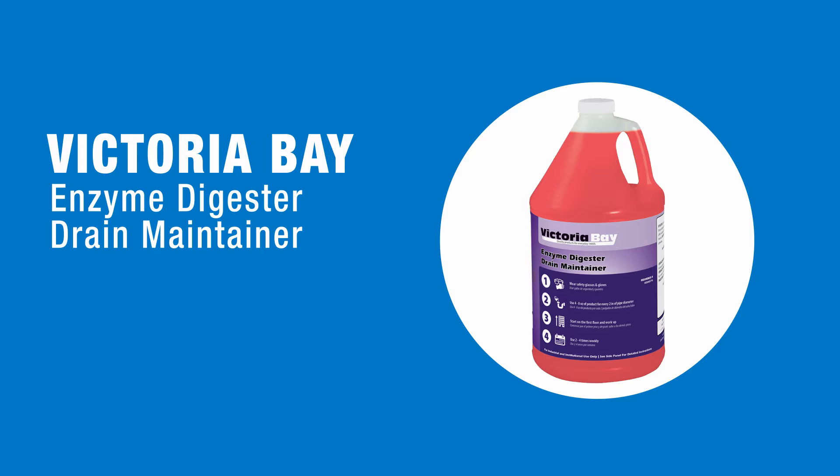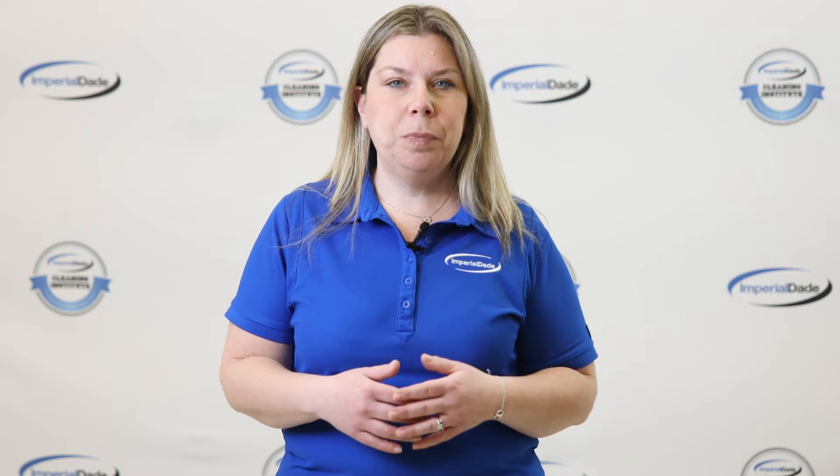The third step is to clean and pump out the grease trap. If you haven't done it before or you want to learn how, check out our article on how to clean a grease trap in eight steps. Immediately after it's been pumped, start treatment with an enzyme digesting drain maintainer. Always follow the manufacturer's recommended guidelines for use with your product. The longer you can let the product sit before introducing hot water and chemicals to the grease trap, the better. That's why you should perform this step after closing if you want the best results.